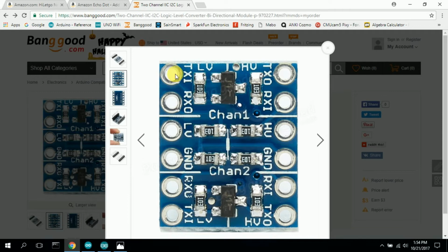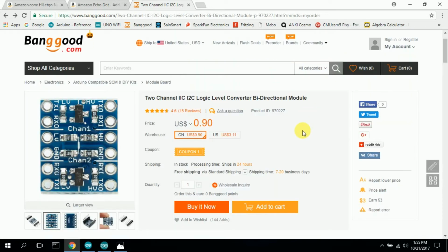And then you go from low voltage TX1 to high voltage TX0, I guess is what it's numbered here. And from the NodeMCU module, I have it come in from transmitting the TX to here. And then I have the TX out of this going into the RX of the Arduino. And that's how it transfers the capital A low voltage to the capital A high voltage of the Arduino. And the Arduino then uses a case statement to trap the letter A, or if it's a letter B, or whatever letter I assign, and then acts upon that accordingly.